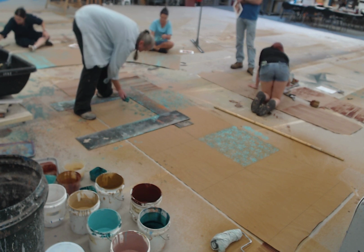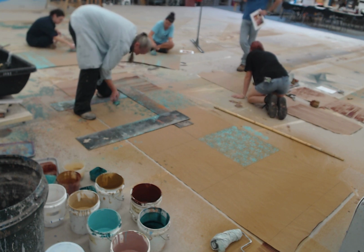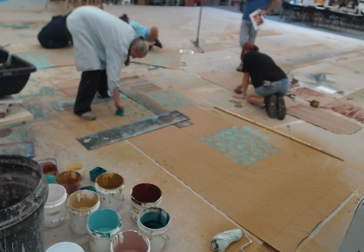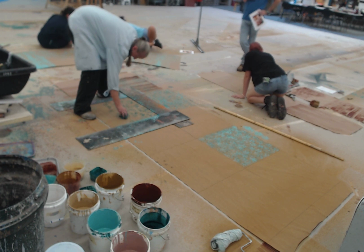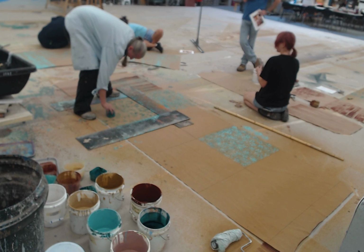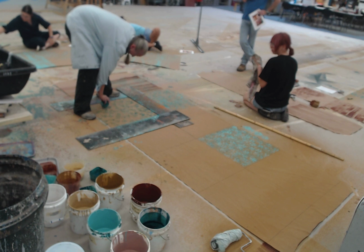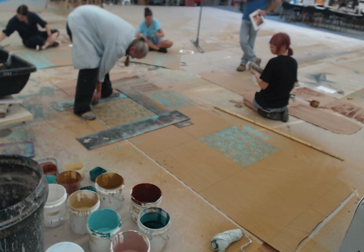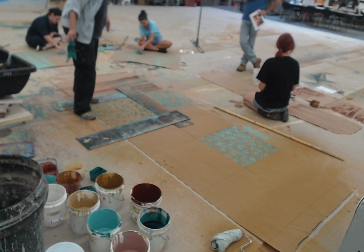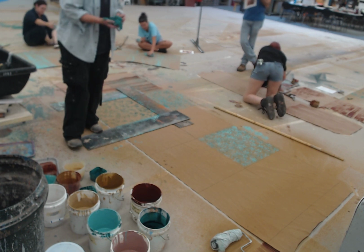Turning it, same way you do with a sponge, in between so you don't get patterning. Once again, viscosity. And I'm going to come clean and say that since this was the paint that I just used for spatter, it's probably a little bit thin for a rag roll because it's soaking in a little bit too much and it's not giving me as much oomph as I would like. It's a little thin, right? So your paint can be a little bit thicker for rag roll.